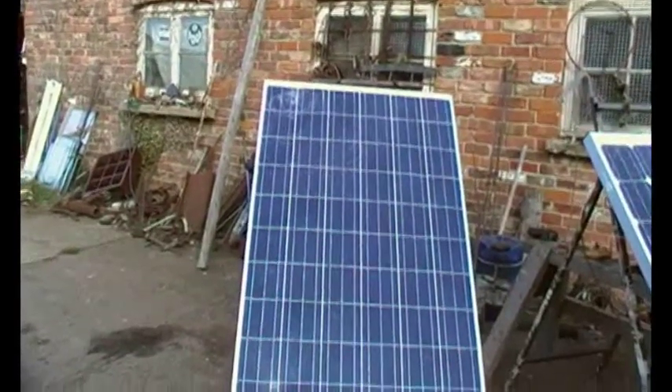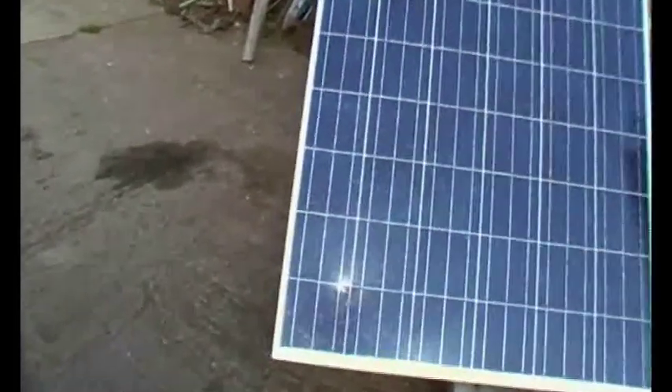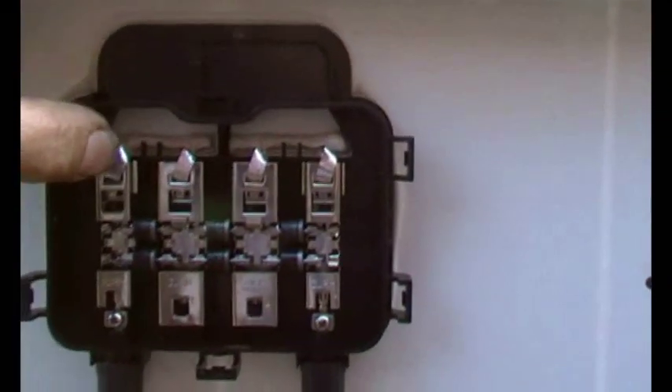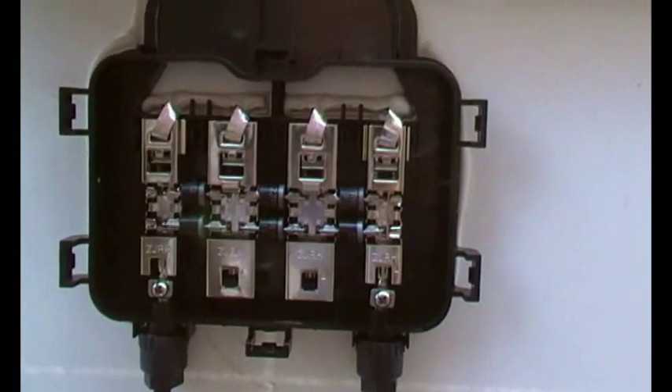This is another panel — a different make. I've already sprayed it with a lacquer. But if you can see: top corner — impact; bottom corner — impact, and it's a crater. There's a big ding. So you can virtually guess that this set won't work. And if you look underneath there's a bend. This is the Trina Solar. Again, one, two, three, four connections for the three sets of wafers. So if anything's wrong with these Trina Solar, it's even better, because you can just connect down here.